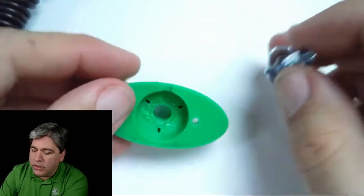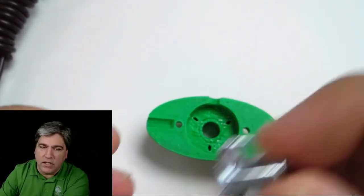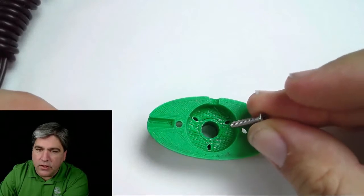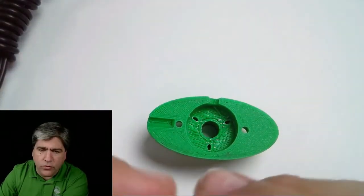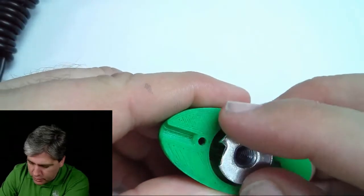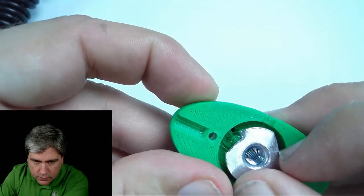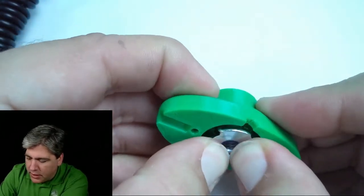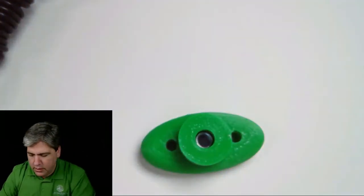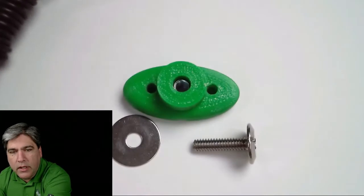In order to get the thread into it, you'll notice that on the inside there's already exactly the spot necessary for this T-nut to go in there. You'll see over here there are three holes for the barbs to go into. So we're going to take the T-nut and place it in here, making sure the barbs line up with the holes. Once they're lined up, you should be able to push it in a little bit — it won't go all the way through. We need to pull this down into the plastic. To do that, we're going to take a long 1/4-20 screw and a washer, and we are going to crank it into the piece of plastic.